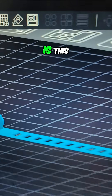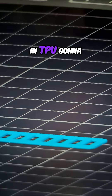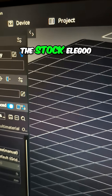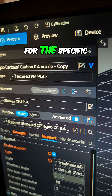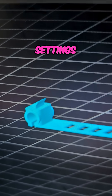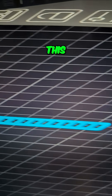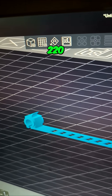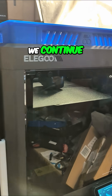What's your prediction? Is this little cable tie printed in TPU going to turn out okay? I'm using the stock Elegoo TPU profile that I altered for the specific temperature settings. It said 220 to 250 for this filament, so I've got it set at 220 or 225 for both the first layer. And here it is.